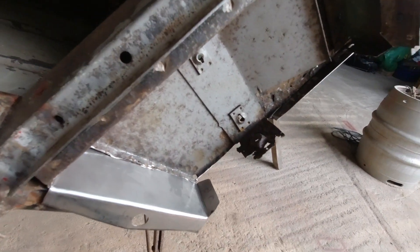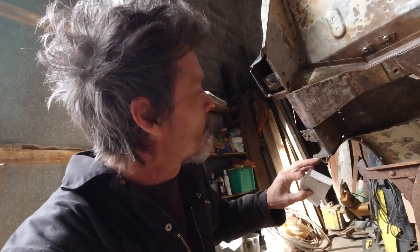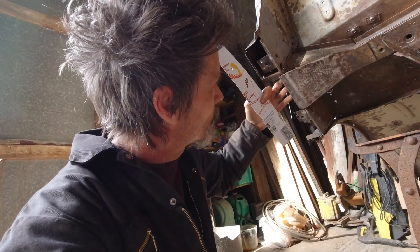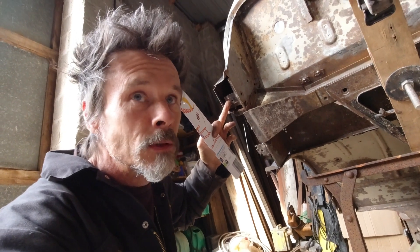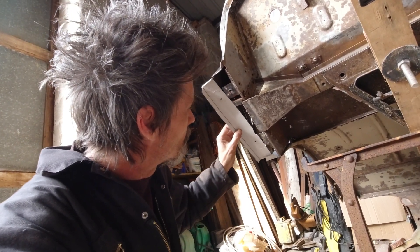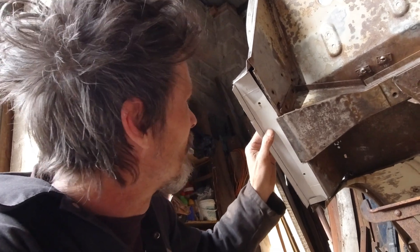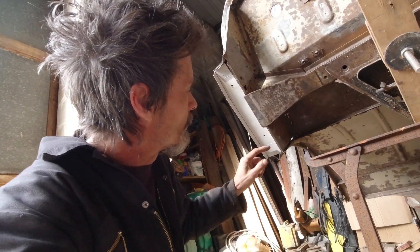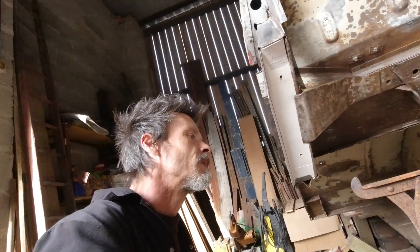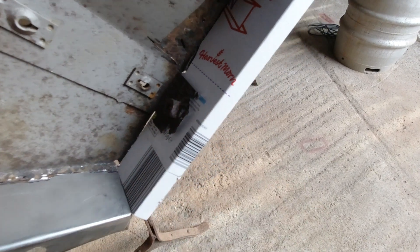It's a bit weird — you cut out all the rusty metal and it actually looks better even though there's a lot less there. Tim has gone back to where the metal is good and where he can put a good weld in, retaining the old bolt holes for one of the side steps. The new piece is shown in cardboard for now — he'll make a stronger steel version that goes up in there, with spot welds where they originally would have been into the corner pieces, so he can weld through from both the inside and the outside. It's getting there.